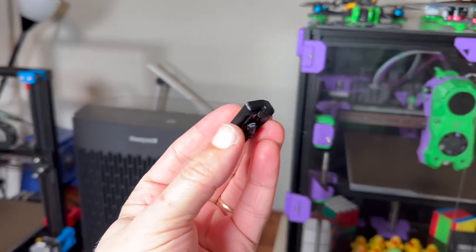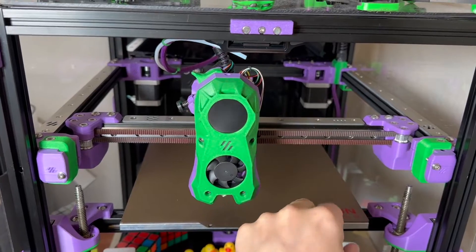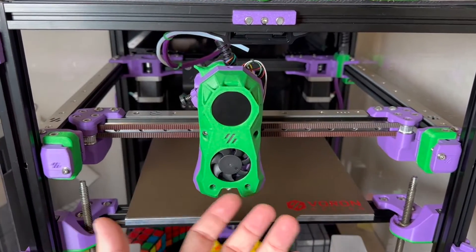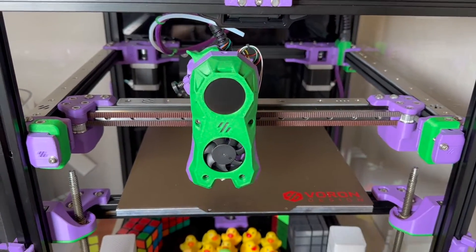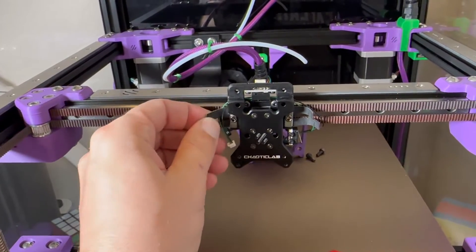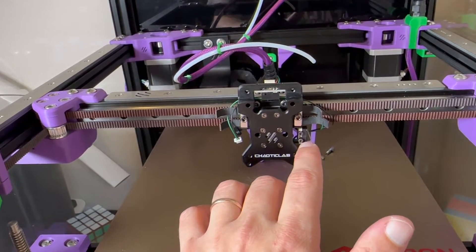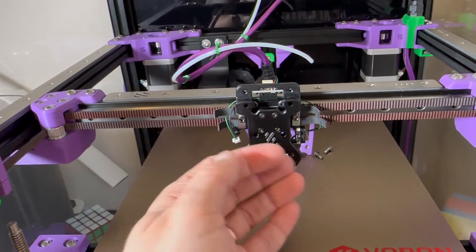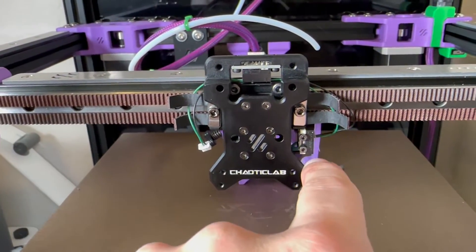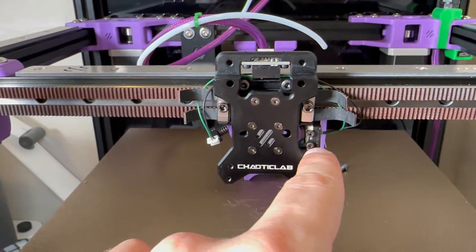Now I'm at my 3D printer. The clips will be printed on the Voron Switch Wire — I have a little bit of PLA left over. The goal is to remove the tension from the belts, disassemble the whole tool head, and rebuild it. I've disassembled the printer and put the Voron tap in place. The belts are a little bit longer than they need to be — I'll probably cut them later. Also, those two screws are super easy to strip. I stripped one of them on the bottom without putting much pressure. I used thread locker so it will hold in place — be careful, don't tighten those screws too tight.